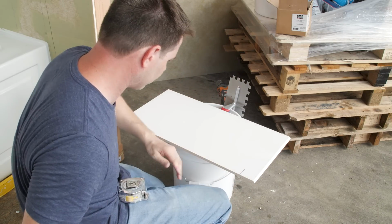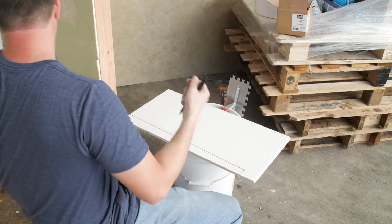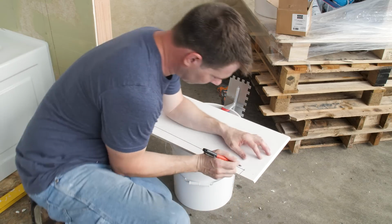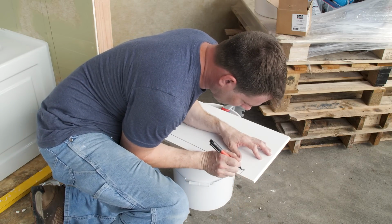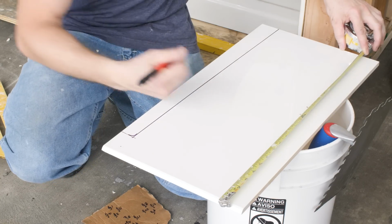Take careful measurements around pipes and valves. To cut around pipes, after taking measurements, you can use a core bit and drill a circle anywhere necessary on the face of the tile. Core bits are available in a wide range of sizes from D&B Tile.